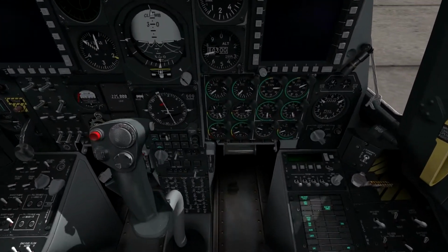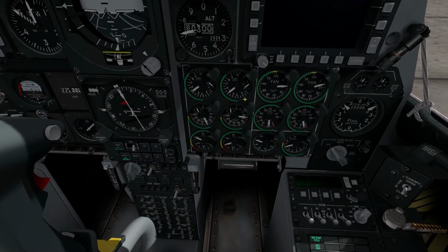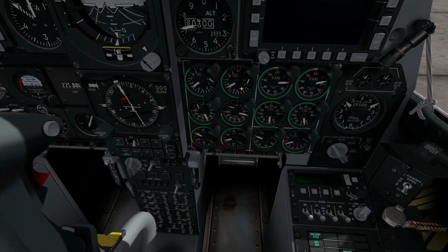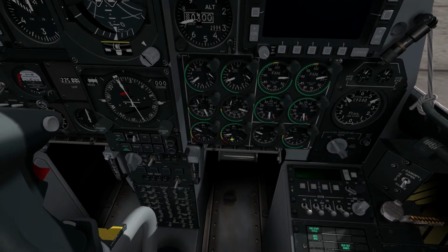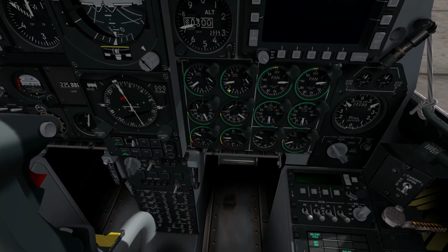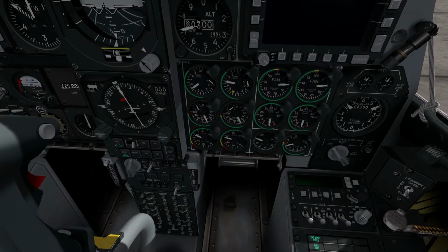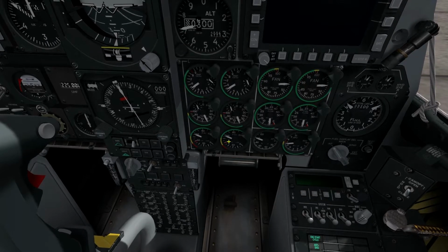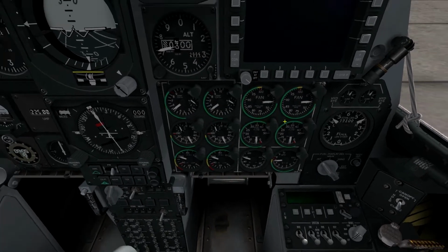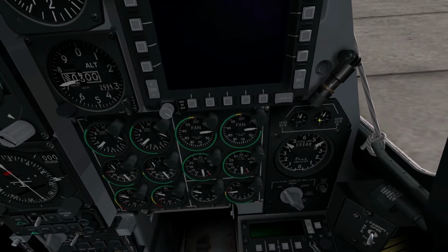And once again, we can monitor the engine here on these gauges. Once again, we've got our temperature here going to 550 Celsius. RPM and oil pressure is rising. So I'm just getting ignition here right at about 700. There we go, and oil pressure is good, right up at 60 psi. We're stable at 60% RPM, and our hydraulic pressure is good at 3,400 psi.